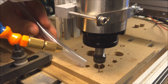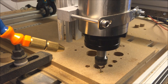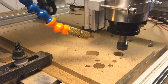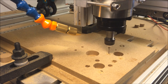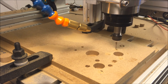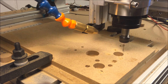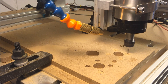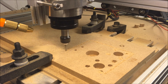The process was very long — you don't see this because I made fast edits in this video. But next time I can mill with one increment depth of 2.5mm, so it's better. The HF spindle is so powerful, it's amazing, and I can mill very fast — faster than in this video. Next time I'll mill my prototype a little bit faster. You see it makes the little pockets for the screws and the profile.